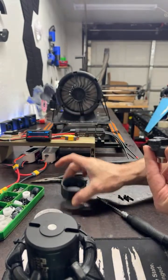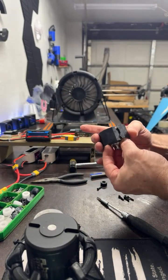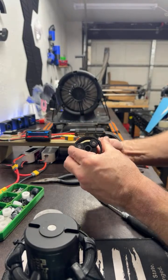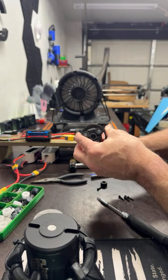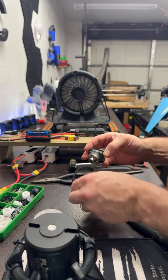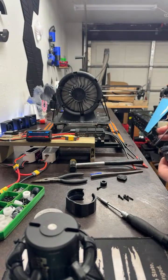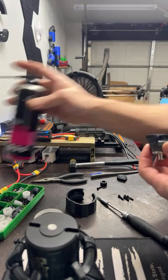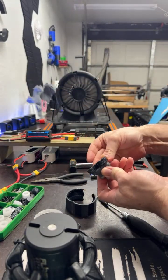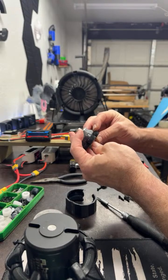So TPU outer ring, as you can see, TPU planetaries and a PLA sun gear. So let me rotate that some more here. Let me do something. Interflon. Hold on, I'll spray this off the table a little bit. Just a little bit. Get her moving a little bit better. Oh, that's better. So yeah, the TPU against PLA, I feel like it's fighting it.